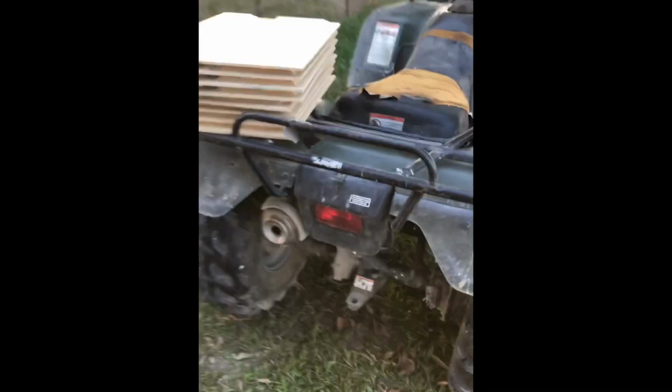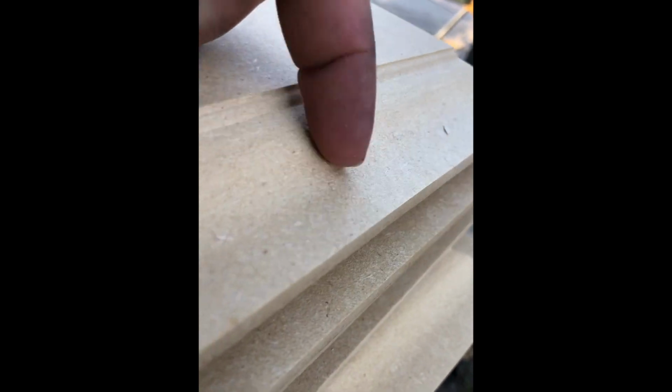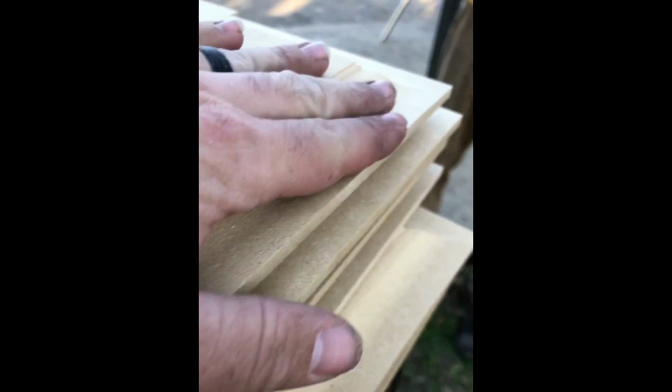And then you come over to the drawer fronts. And so the drawer fronts, we're gonna sand the top with the sander just to kind of clean it up with some 120. And what we'll do is we actually get in here. Y'all can see the texture. I mean, it's kind of fuzzy. And all of that just kind of shows up in the paint. Real fuzzy. So what we do is we take some sheets.